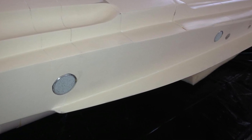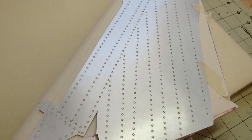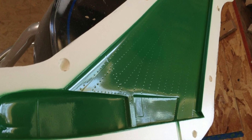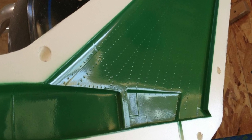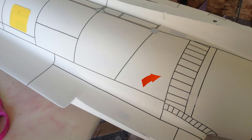With all the bits fitted and molded it's now time to get the plug perfectly smooth and ready for molding. Using an outside source to cut my rivets, I'm now applying the rivets to the vertical stab, making the mold, and making the final part which is pre-painted. I'm now adding surface detail such as access panels, maintenance panels, panel lines and so forth.